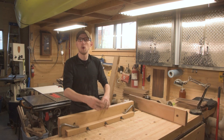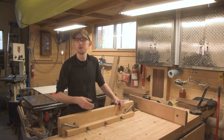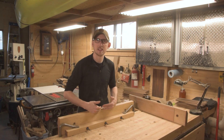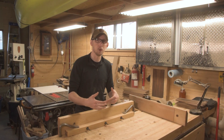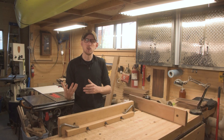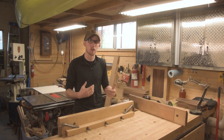The bracer bar on the back gives your vise a wider base on the overall bench. You can make these vises as complex as you want — some of the coolest ones incorporate a whole raised bench design, basically a full workbench with dog holes attached to the back of the moxon vise. If you're doing a lot with dovetails that's really beneficial, letting you rest your panel in the main work area and have it lined up perfectly when transferring pins. There's a lot you can add to a moxon vise, but the best thing when starting out is just to have one in your shop.